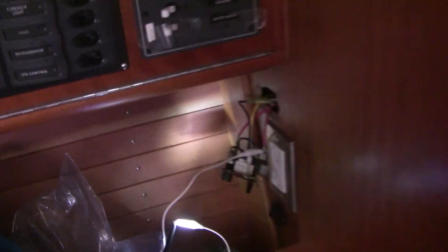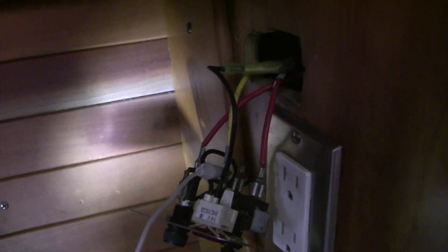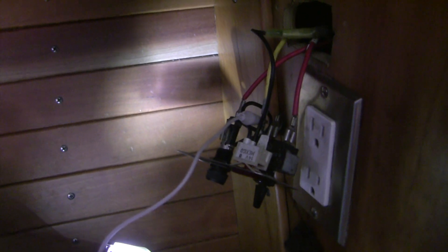To do that, I'm going to need a couple of alligator clips. Now let's check out the automatic feature of this. Here's my power probe — I've got it tied into that red line, and that gives me 13 volts there. So that tells me the auto portion of that switch works fine. And then switching over to manual — the manual works fine as well. So we've proven this switch is good. Let's go down to the sump and see if power is getting there.